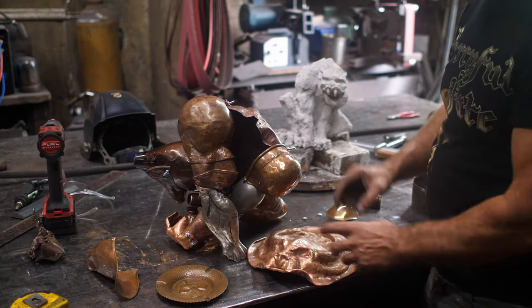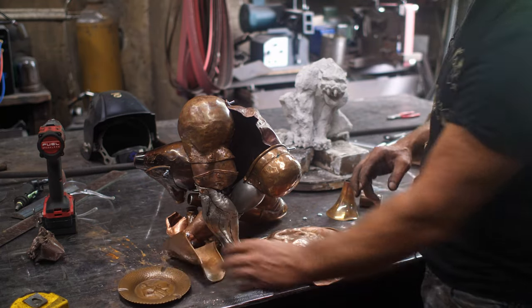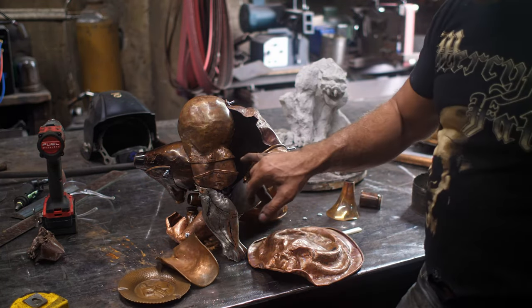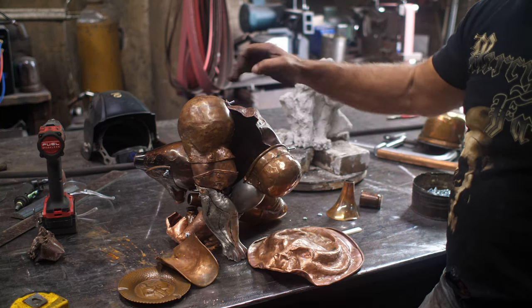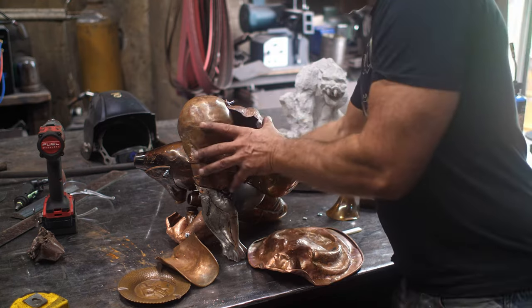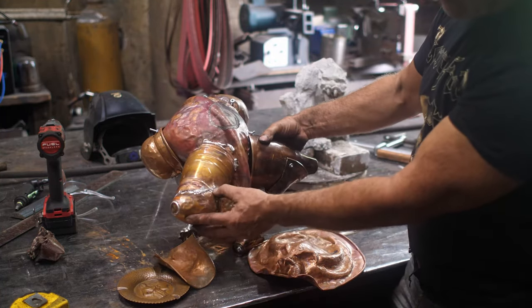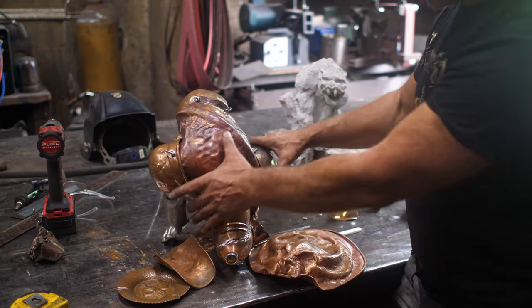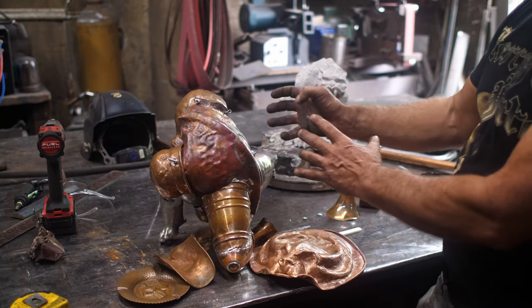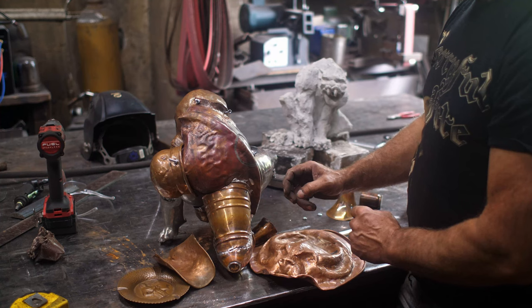I'm stylizing to try to incorporate the various existing shapes. So that's where I'm at. Combination of joinery. I'm using copper rivets to join some of the pieces together, and in other places I am simply soldering the pieces together, which goes quite quickly, but is not as sturdy. I have to be able to get a good mating for those pieces to get together there. Yeah, in the thick of it now.